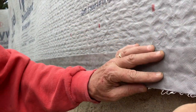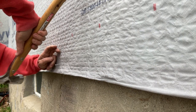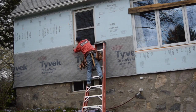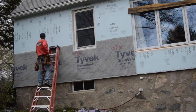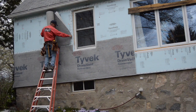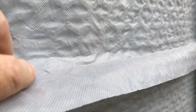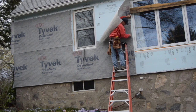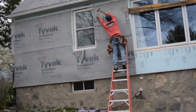At the bottom of the wall, the flap is tucked under the mesh to provide an insect barrier. I run the drain vent over the window and then cut out the excess afterward. The second row stacks atop the first with the mesh butting the previous course — there's no overlap. The flap is typically overlapped in the middle of the wall, but if you don't have stucco or mortar, it's not really going to do anything. I trimmed it off and used it to wrap the edges of window openings for added protection against highly determined bugs.